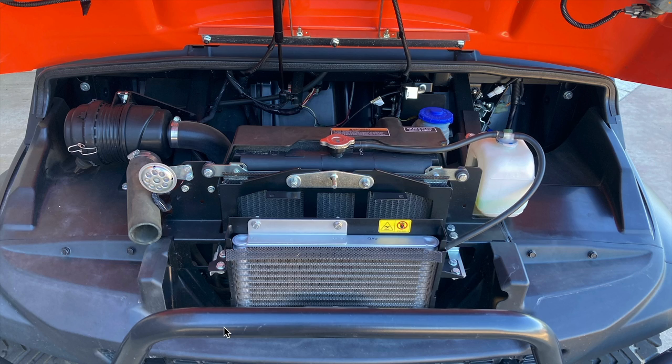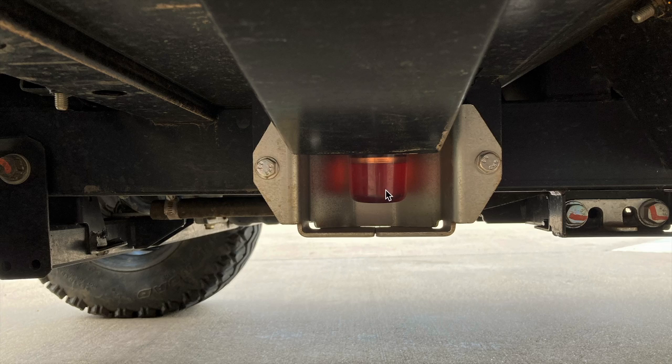Continuing with our overview of the machine, here's a view underneath the hood. Up front is the hydraulic oil cooler. This is for the fluid in the hydraulic tank, not the transmission case. Right behind it are the radiator and overflow tank. On the passenger side is the airbox with 2 filters. And finally, on the driver's side is the brake fluid reservoir. Brake fluid is something that doesn't need to be changed very often, so it's the only item I won't be servicing. Lastly, here's the fuel filter. It's located on the passenger side of the machine, about 2/3 of the way back.